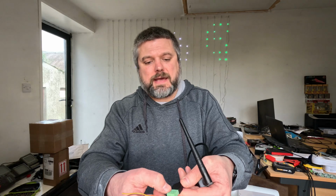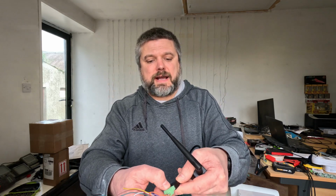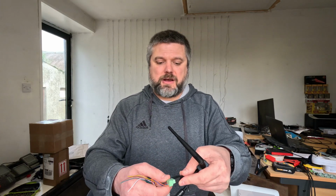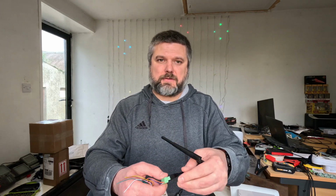If you take a look, you'll see RX or B. It's also got TX, so the RX is the one which you send the TX out of the other. That's going from the TX out of my chart plotter, and the TX then would be the input of the chart plotter or whatever else you wanted to feed NMEA information into.